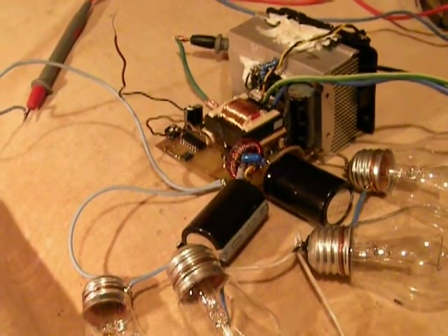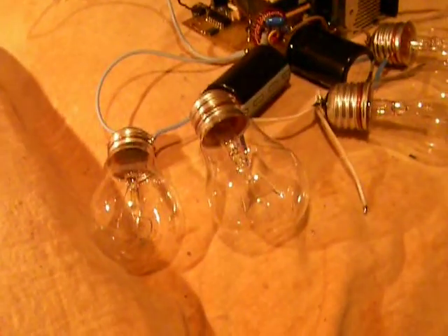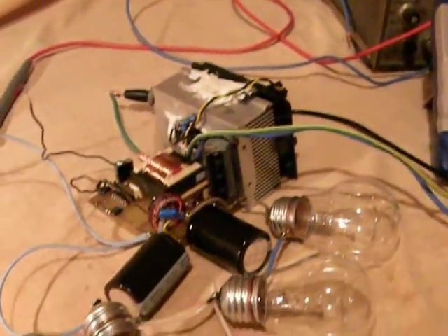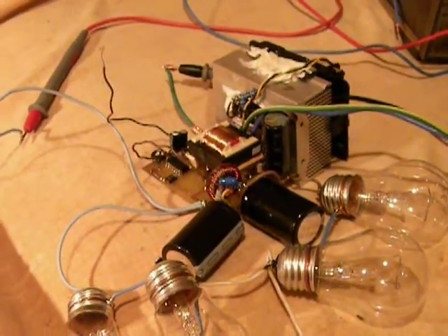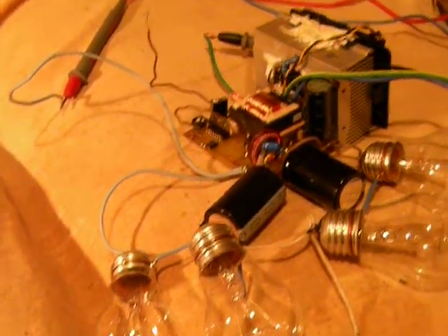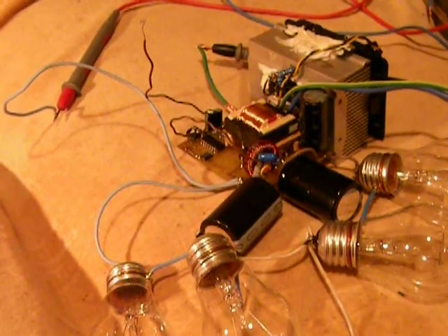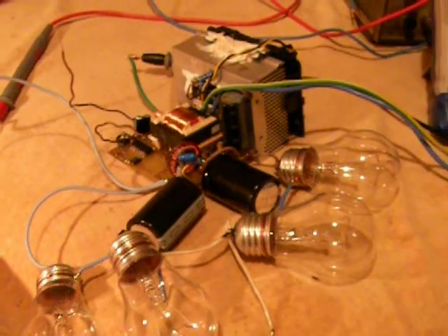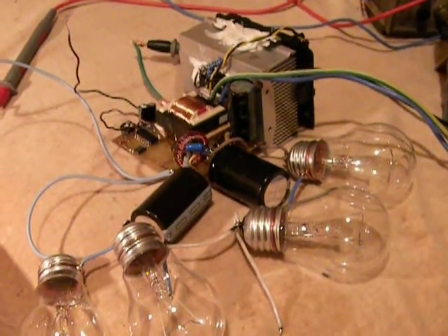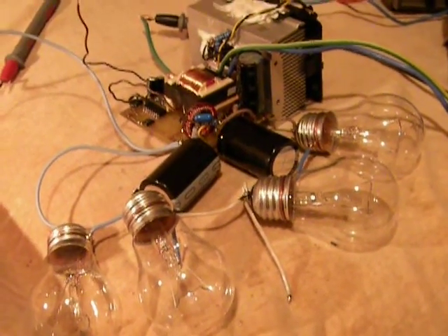You've probably already seen the video with the Zetagi BV-131 powered from 12 volts in my car. Well, the problem is that that converter at 50 Hz is not efficient at all — the efficiency is below 25%. So I just built this converter hoping that the efficiency would be much better.